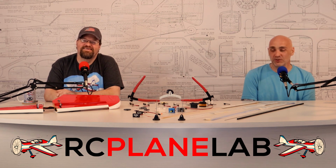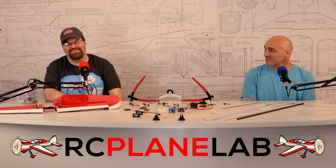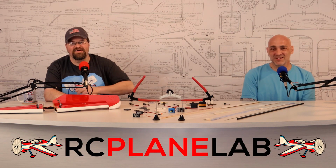But anyway, I'll put a new one on and trim off the legs that I don't need, just for a nice clean look. And then I probably go overkill. I'll get my Dremel with a sanding drum. I was going to ask you about that, because I could see you doing that. Because mine are all sharp. Yeah, don't touch it; it's going to cut you. If you cut off a leg with a pair of side cutters and it leaves those nasty square edges, I'm not a big fan of that.